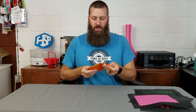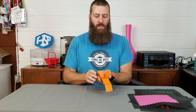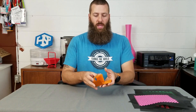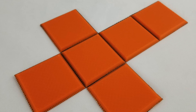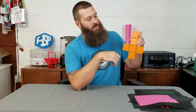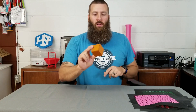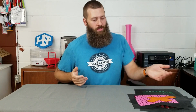Printing on squares is cool, but can we do something more functional? I jumped into Fusion 360 and designed a box form — printed the same way: first layer down, screen placed, then printed the rest. I designed it with a 46-degree bevel between each panel — the extra degree just to give a little slop — and a 0.2mm spacing between them to give some tolerance for the machine.